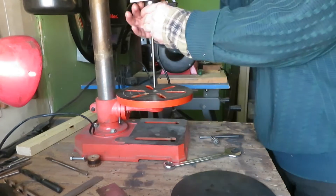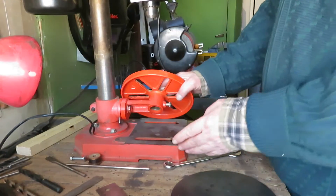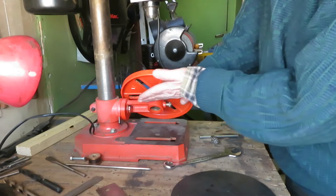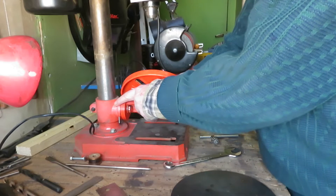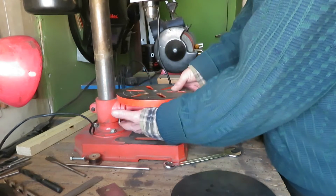In this case with this table I only needed a piece of sheet of 1mm to lift the table 5mm. Now this fix, as I said, is only an emergency fix, because putting a piece of metal there makes the bolt tighten this part at an angle, and that might ruin the bolt or the thread of the column. So this is only for emergency uses.